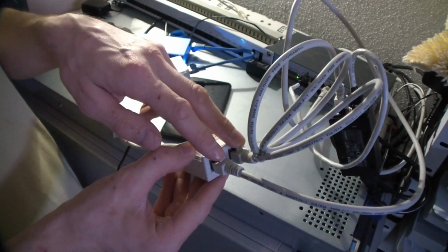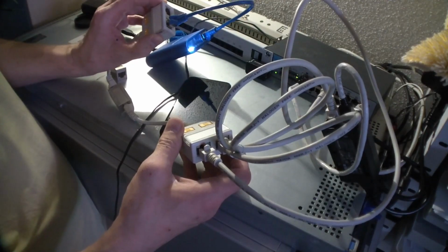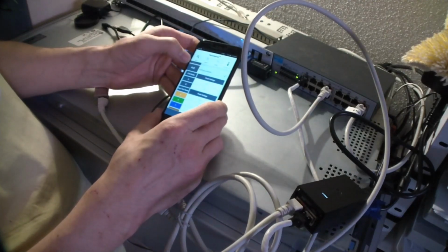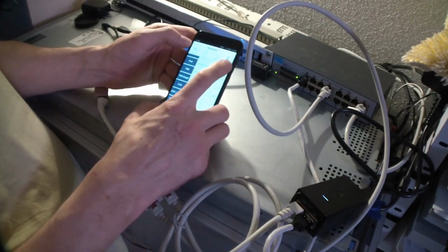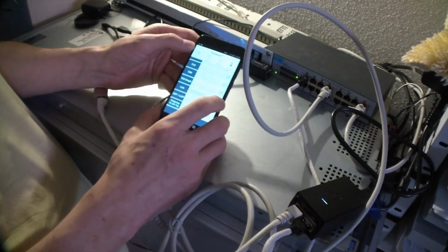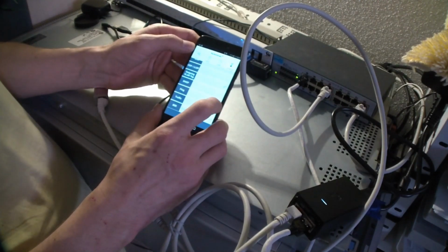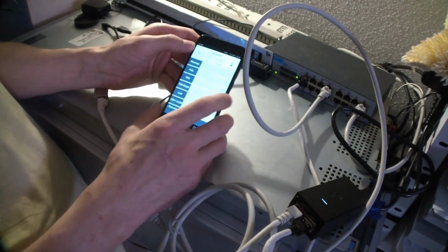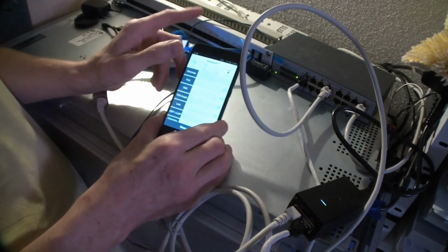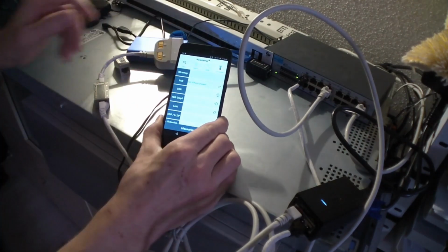So imagine this is your patch panel or your server room or whatever, network cabinet, and this is your office side. So now I should have a full 100 Mbit link. Okay, we can test for PoE. Let's do the TDR test and the TDR graph and the link. The rest is more or less uninteresting for now. Wire map, no. So we shouldn't have any PoE, but we should have a link, 100 Mbit. Of course it doesn't detect any voltage.